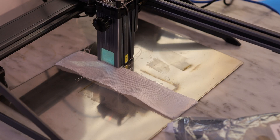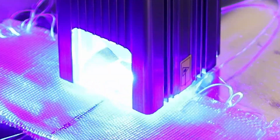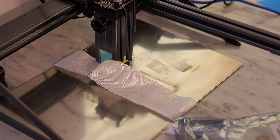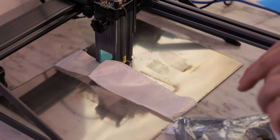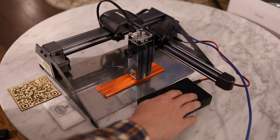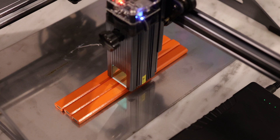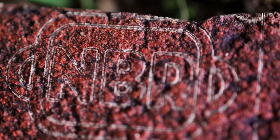Now I've got some fiberglass cloth. Oh wow, it's making some noise — that means it's probably doing something. Yeah, that cuts straight through the fiberglass. The reason why I want to see if it can cut through fiberglass and carbon fiber is this could be an invaluable tool for doing composite layups. When you're producing a complex shape used for a car or an airplane, you need to cut out multiple pieces of carbon fiber and lay them up against a mold. Being able to cut out any arbitrary shape with a laser cutter would make this process a whole lot easier. I'm going to show you that you can actually power this whole system off of a tiny little power brick. Being this small and light makes this machine super portable — you can plug this thing into your cigarette lighter and start engraving out of the back of your car. You can even take this around town and start doing laser graffiti like some kind of laser Banksy.